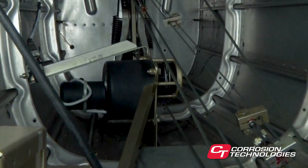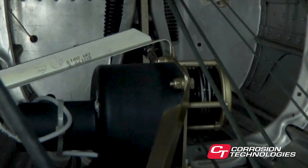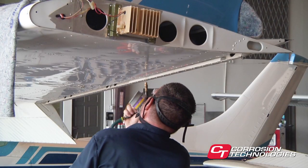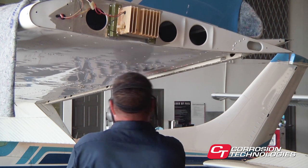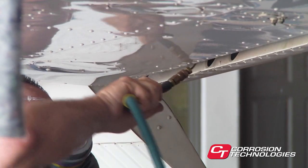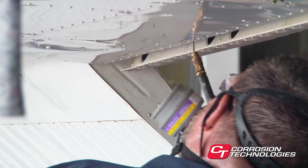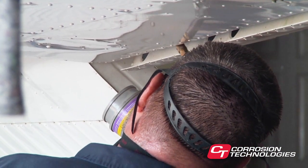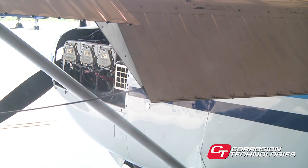Amazingly, the final coating of CorrosionX is only about four ten-thousandths of an inch thick, and that's all it takes for up to two years of protection. It's easy to use more CorrosionX than necessary. Ideally, you want to use an amount sufficient to ensure complete penetration, without spraying so much that the aircraft weeps excessively. Although it certainly won't hurt anything if excess product is used, the excess is superfluous from a performance standpoint, and it will tend to weep from the aircraft long after application. If an owner complains about weeping, explain that the product is penetrating thoroughly to reach unseen corrosion present in seams and around rivets. CorrosionX is harmless to paint and can be easily wiped off the aircraft's surface.